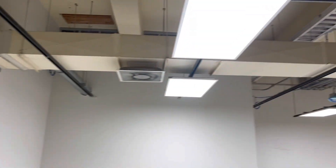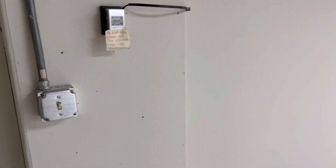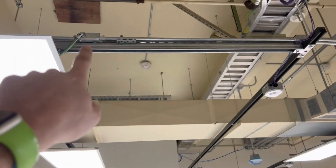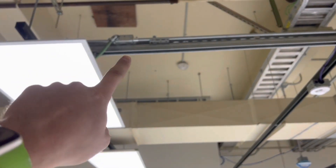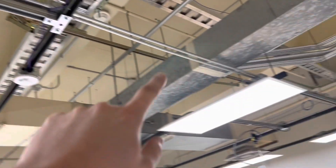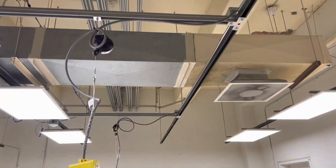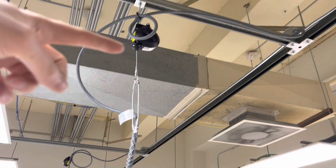Back in this room, the occupancy sensors do work - I just walked in, it was pitch black, lights turned on, didn't touch the light switch. Got these light switches labeled right here: MT NOW 2447, circuit 32. Added some support brackets right here because these boxes were just floating. Added some pipe supports, got a strut nut to hold the box down, labeled all the covers in here - every single cover except for one which has no splices in it. Added strut support for the floating boxes.